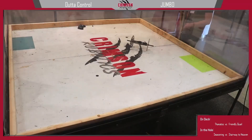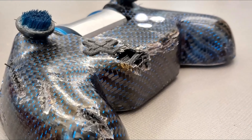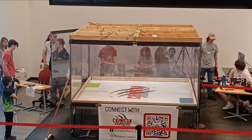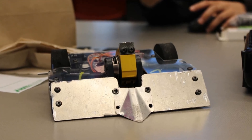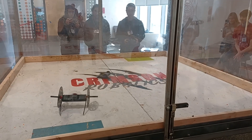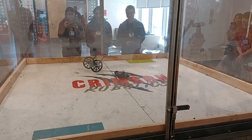A very close match, but the electrical gremlins seemed to return for him in the end. That's not to say Jumbo wasn't effective — one hit nearly got to his battery. I scraped by for the win but had a lot of repairs to make: one motor locked up and the other came unscrewed from its mount. Once things were fixed up, I went into my next match against Spices, another Viper kit with a vert. Compared to Malicious Mouser, it had better front armor, meaning I had to focus on getting to its sides and top.